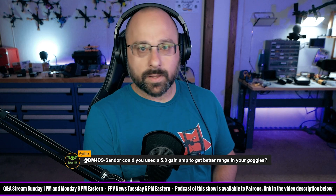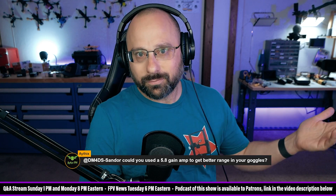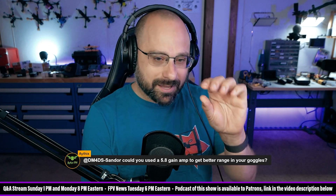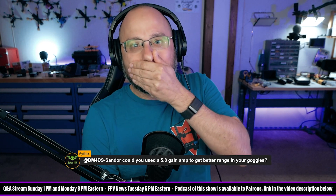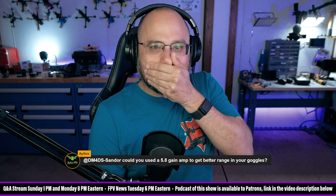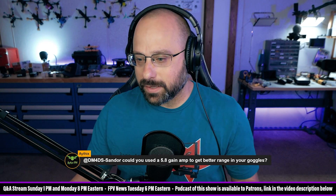It's like this: let's say I was in a room with a giant industrial blower fan, and the fan was so loud that you literally couldn't hear my voice. And I give you a recording — all you can hear is the fan. If you turn up the volume on that recording, all you hear is a louder fan. You can't recover the voice. The signal-to-noise ratio is the same. So receive amplifiers are not the magic bullet that people think they are.